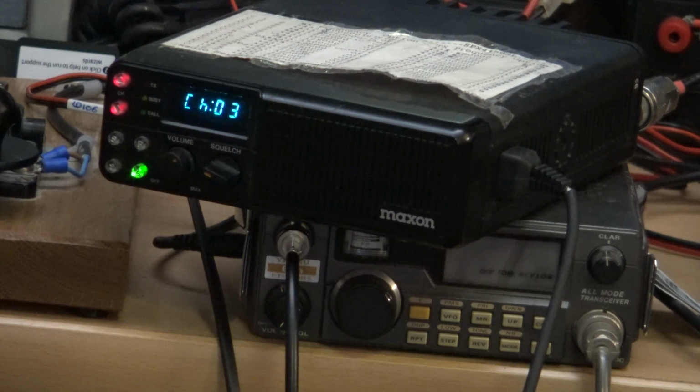And of course it was readable nearly all the way back. But this is a difficult terrain for a radio test. So that's why we do this, that's why it was chosen a few years ago. So I hope you enjoyed the demonstration which shows that UHF in this rural environment, where there's a lot of trees and a lot of dips on that route and a lot of cuttings into the rock, doesn't work very well at all. But we use UHF nearly all the time, but we go through the repeater.